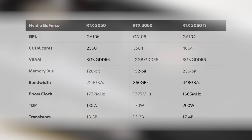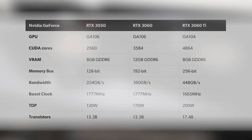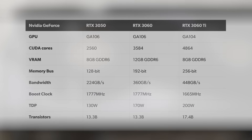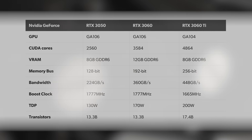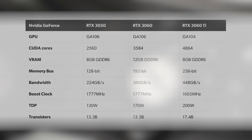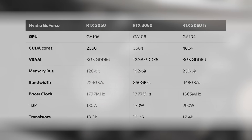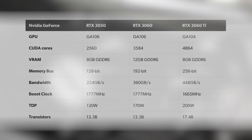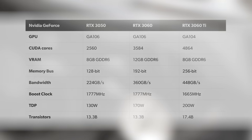CUDA cores: 2560 of them, in line with the laptop RTX 3050 Ti, but curiously this is a cutback version of the RTX 3060 silicon — GA106 — as opposed to the smaller GA107 found in the notebook. Memory interface is 128 bits wide for 224GB per second of bandwidth. In all dimensions then, this is a significant reduction from RTX 3060, so we need to keep expectations in check on the performance profile of the card.